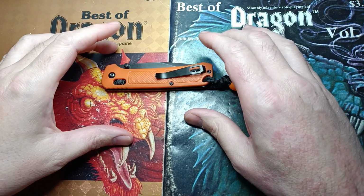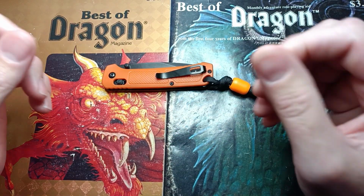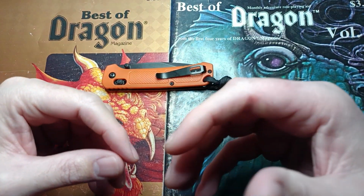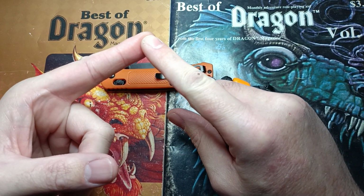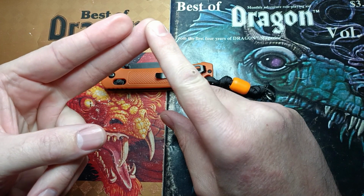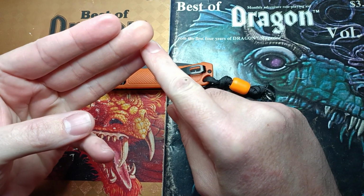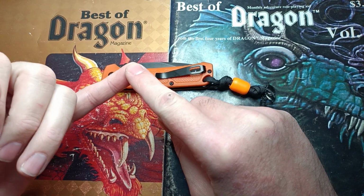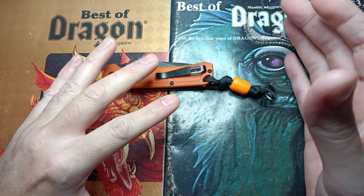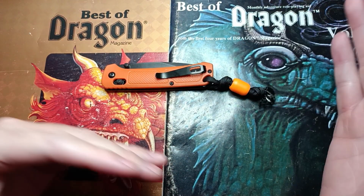One of those is the question of using cut time instead of counting the number of cuts specifically. And for us, we get consistent and repeatable results with the same steels. We get consistent results with like 8CR13. We get very consistent results about 2.5 hours on a factory edge, about 3.5 with a brand new 18-degree edge. 3CR will push about an hour and 20 minutes-ish, give or take, on a factory edge. And then a new edge will take 2 hours 20, 2 hours 30 minutes. D4 will be about 4 hours. It's reliable and it's consistent, and we get a good idea of what the steel does. And we have found some softer examples of steel doing that. We do get to watch the edge degrade in real time as we do that with the sharpness tester, but that's out there.